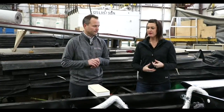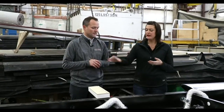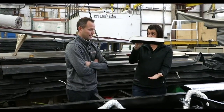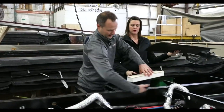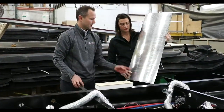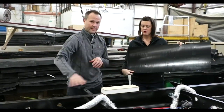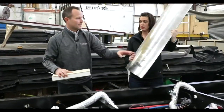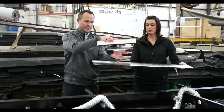The term subfloor comes up quite a bit. The subfloor is underneath this, between your floor and the bottom of the trailer. The floor sits right on top, air comes in between, and on the bottom part we have thermofoil insulation that is laminated to the underbelly. You have all your warm air floating around in there, insulated by the floor, and this is reflective heat — it reflects the heat and keeps it in between there where the tanks and everything else are.